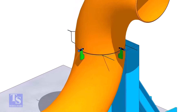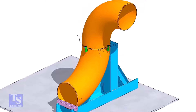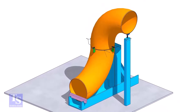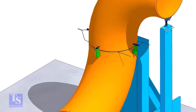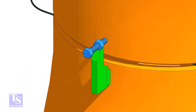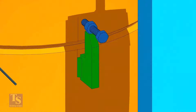Put the other elbow and match the center lines in the direction you want to rotate the elbow. Tack weld an adjustable support below this elbow and adjust the height. Check if the gap is correct.